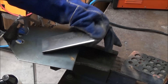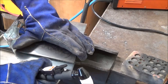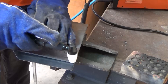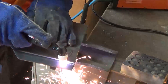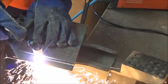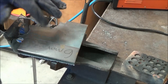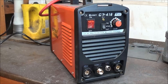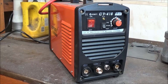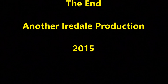If you just want to do a straight cut, get yourself a bit of 6mm steel, which is just the right thickness to hold the head off the work surface, and you can also use that as your straight edge to run it down. Just press the button, the arc starts because it's close enough, and this is just real-time cutting through 3mm steel. You can see that it cuts through it quite easily. It's not a bad job at all really — a little bit of dross on the underside and that's it. Don't be put off by all the expert advice out there — if you're just a hobbyist, this machine will do you just fine. Well, that's it — have a look at my next video for my first attempt at TIG welding with this machine.